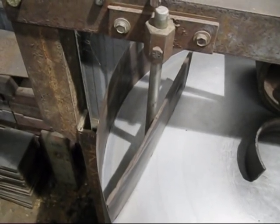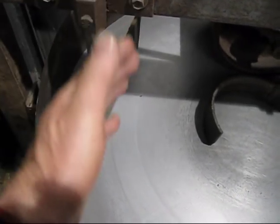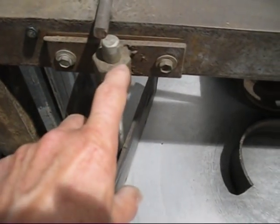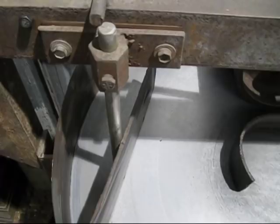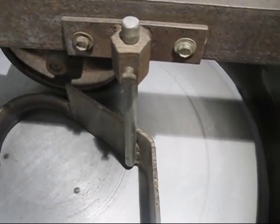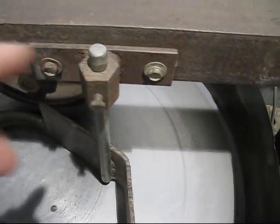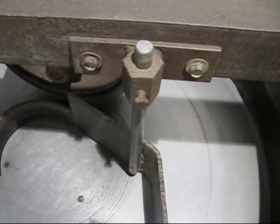Here is a closer look at the ploughs. There's a screw there, so I can adjust it that way or up and down. Like I said, all that does is redirect your sand underneath your compactor roller. The exact distance there to the centre of it doesn't really matter that much. It's probably up to you when you build one. And here is the other plough. This actually breaks up your sand. Same idea, there's a little screw, so I can adjust it up and down or around. And that position from the side of the muller is a bit up to you, where you exactly want it.